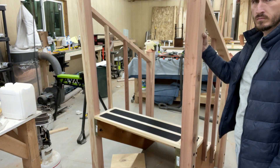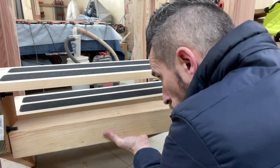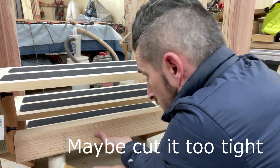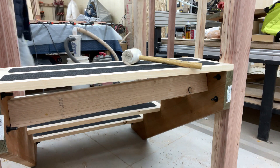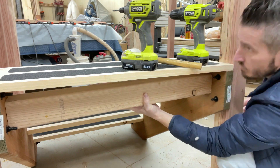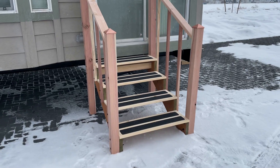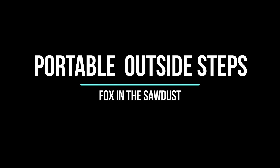I thought I was done — until that happened. It's the disadvantage of working with soft woods, and I didn't think to put any cross supports on when I was building it, so that's what I'm doing now. I took a piece of 4x4 dimensional fir that was sitting around the shop, cut it to spec, hammered it in, then took some two and a half inch wood screws to secure it in place. I might have overdone it with the screws — I'm pretty sure I put five on each side — but the 300-pound hula dancer that gets on these steps is going to really appreciate the extra effort. And there you go — finished project delivered to the customer, which in this case was an RV dealer. If you like what you saw, don't forget to like and subscribe, and we'll see you around next time.